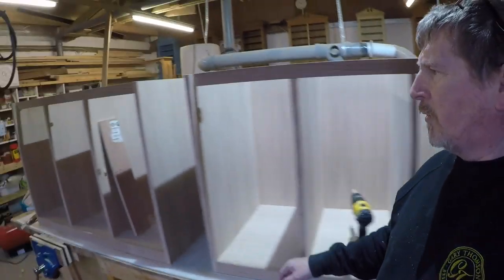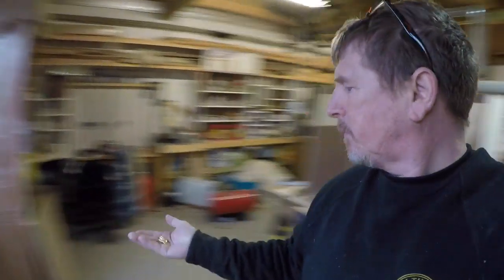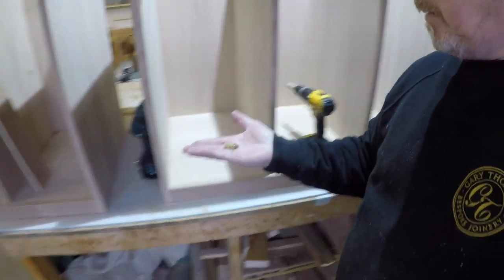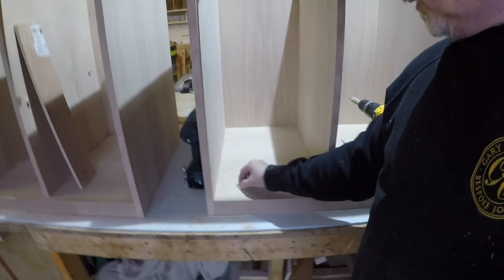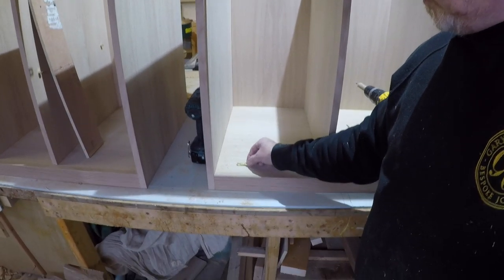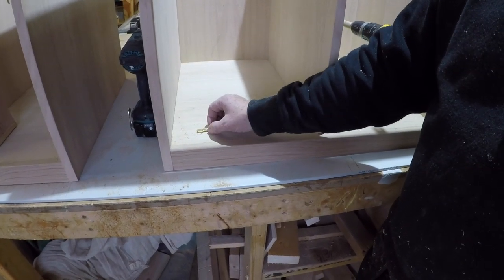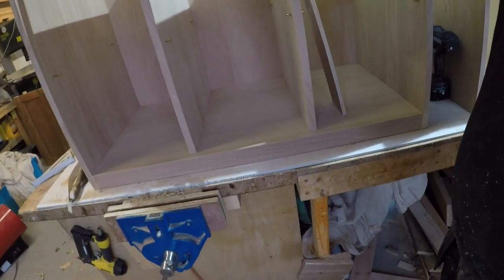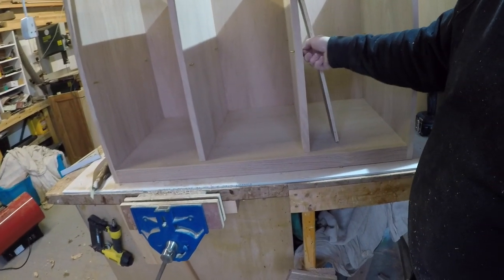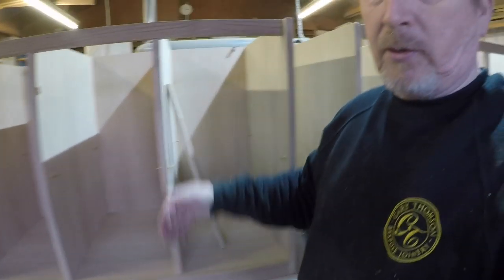And also these things, I'll show you the shelf supports here, and I buy them by the thousands. If you look at the two of them together like this, I have to make sure that whatever board they're going into, they're not going to touch in the middle. Now this is 20mm thick, so that's fine. If it had been 18mm thick, this would have hung out slightly because they would have been touching each other.